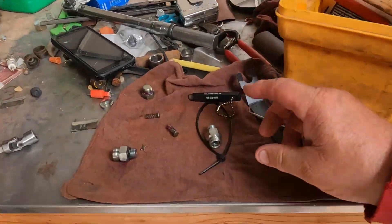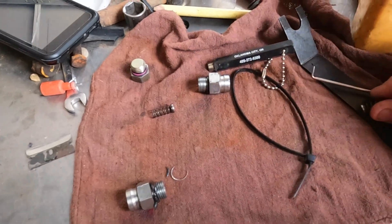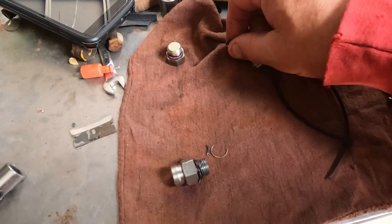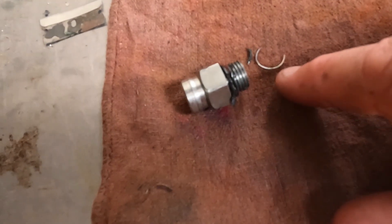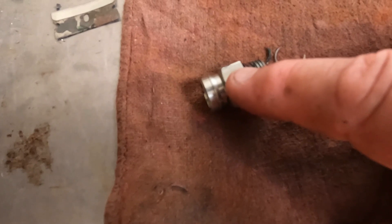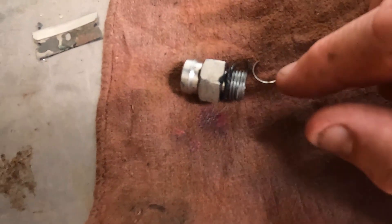I've got the quick disconnects out and I'm going to show you what I've got - I got some sad news for my wallet. Here's the first one I took out. Here are the little springs and stuff that go in the back - they actually sit in here, you just don't want to lose them. I keep a magnet on that. But look right here - I took this off and this was loose. This was not tight. And this is what happens: the Loctite that they use is junk. It makes these loose. They sit there and shake, and you can see how this seal blew out. When it shakes, it destroys the threads.